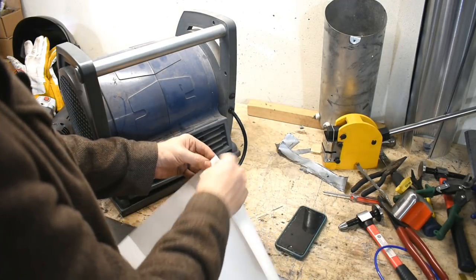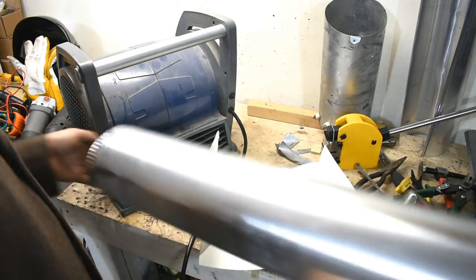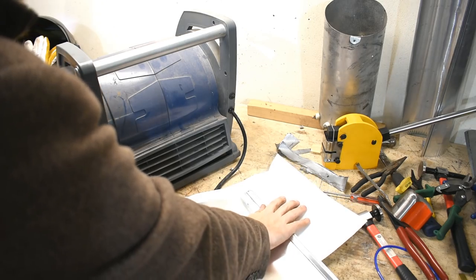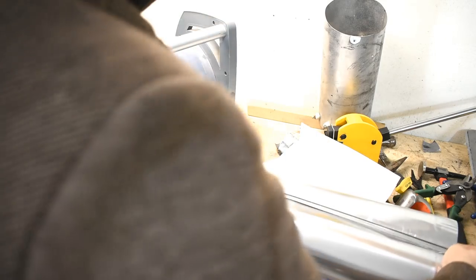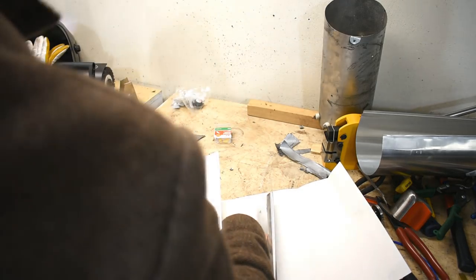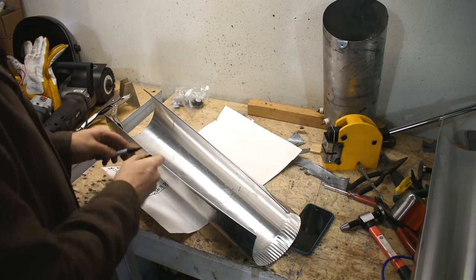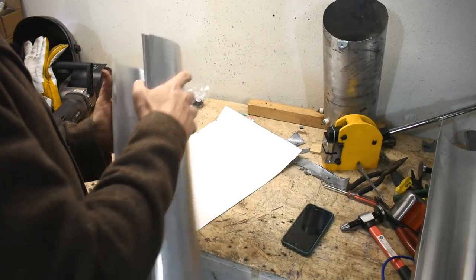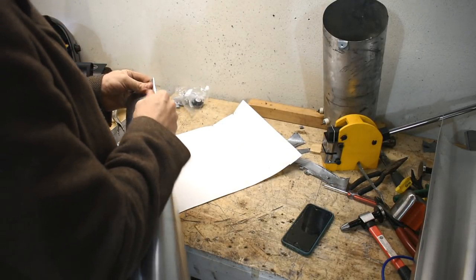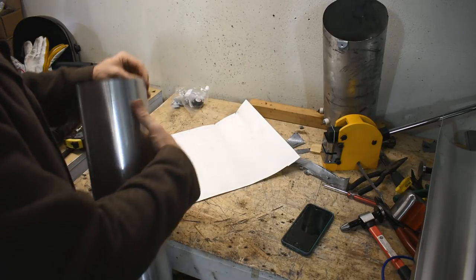Sounds like a job for some cardboard — I should be more clear, I'm making a template, not making the shroud out of cardboard. I have some 4-inch aluminum dryer pipe for this. I'm marking the location of the creases and folding them — these are very thin aluminum so folding can be done barehanded, although be careful as some edges are quite sharp. We generally go with aluminum vent and steel elbows; aluminum elbows kind of fall apart. Proof of concept — that's the plan.